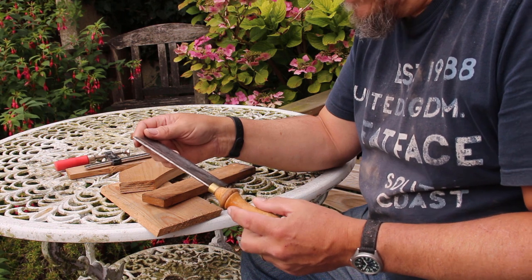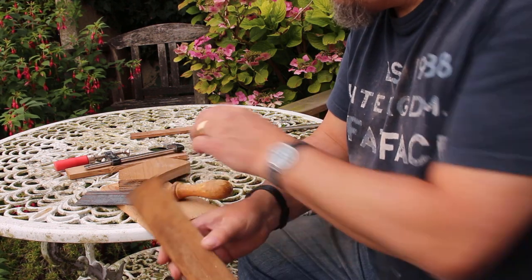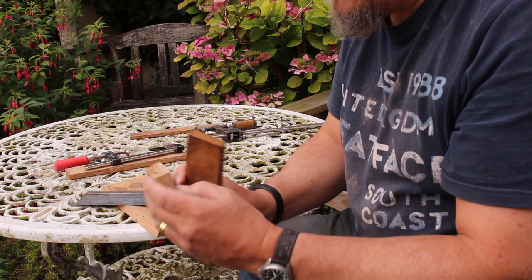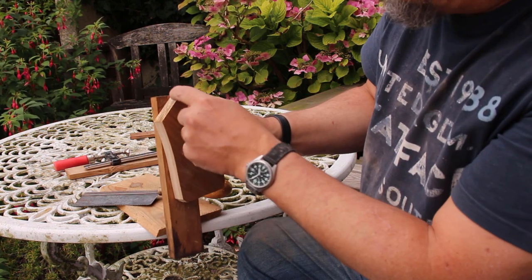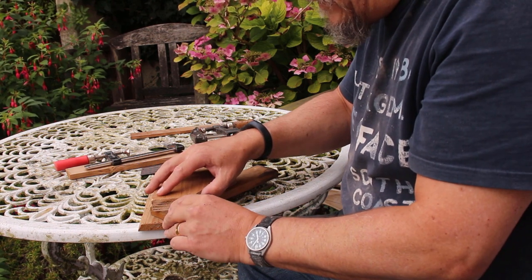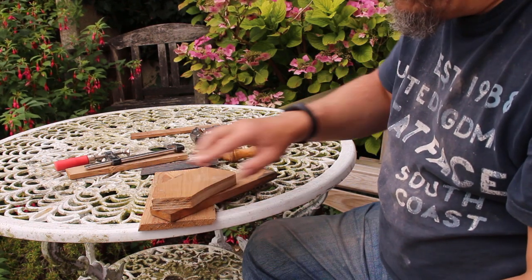This is a gent saw — in fact it's my dad's old gent saw, so it's seen a bit of action over its life. What I've done here is to simulate the headstock — I've marked the curve that you get on the traditional Epiphone headstock. Kevin cut a block of wood — a piece of plywood with an oak top — so he knew it was at 90 degrees. He then laid it across the headstock so you can see that we're cutting that corner off and making it a straight line. Then with scrap wood — imagine this being the headstock of the guitar — this is our guide, along with some waste wood to stop breakout as you break through, just to protect the back of the guitar from any lumps falling out.